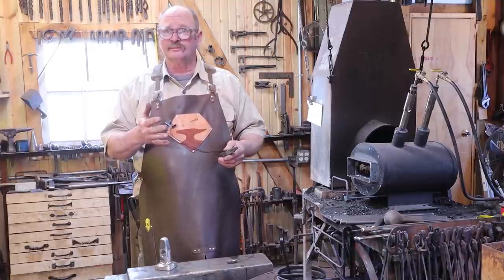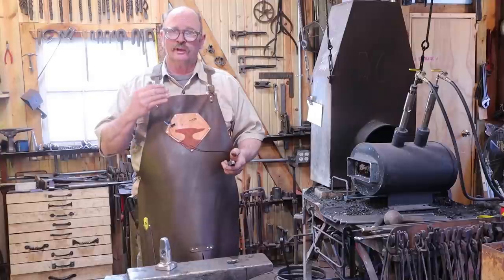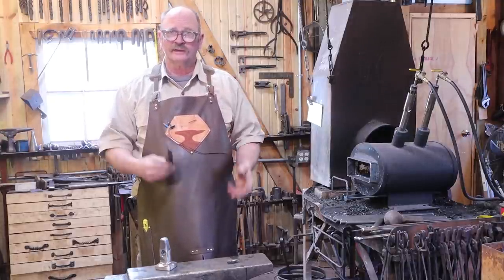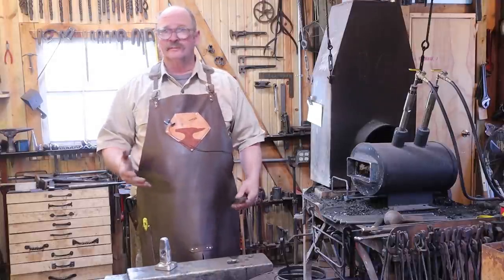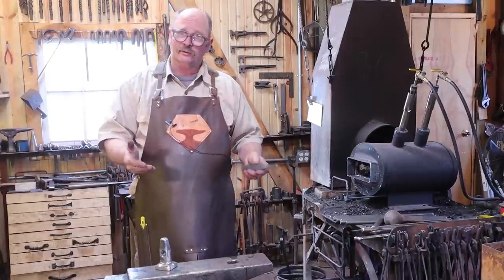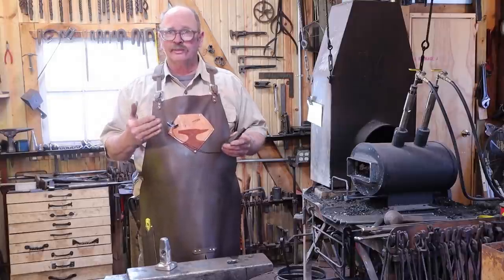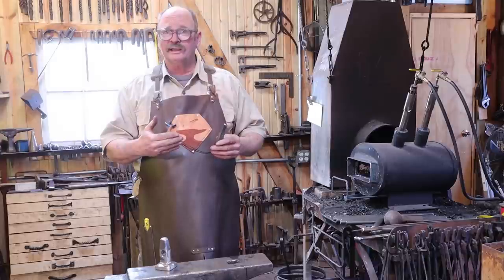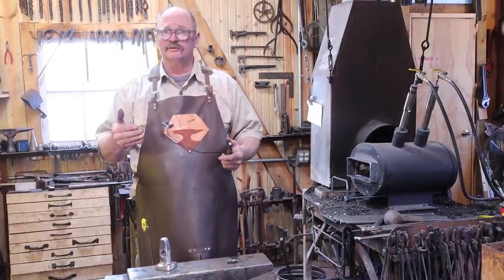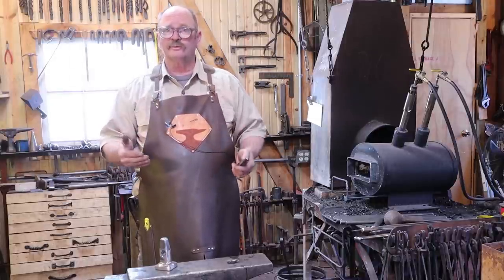This may have also been a little lower temperature, so I think 1500 is probably in the right range. The only way to really know is to do it in a temperature controlled oven, make 20 or 30 scrap pieces of identical sizes, harden them all at different temperatures in different mediums — oil, water, air — hardness test them, and break test them to see what the grain structure looks like, ideally under a microscope. I don't have a hardness tester or a microscope, so this really is something where we're just making best guesses in a blacksmith shop. We don't have the ability to do the thorough scientific examination that would be ideal.